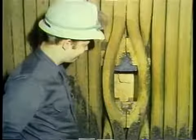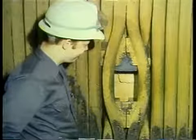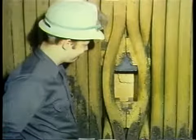When looking at inspection doors from inside the boiler, watch for two things: blockage from ash or slag accumulation and deterioration of the refractory in the inspection door openings. While checking the water wall, inspect the radiant superheater if your boiler has one.